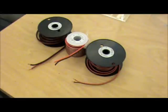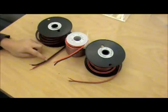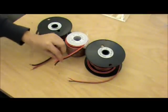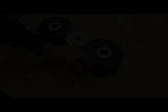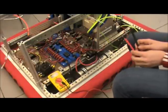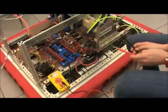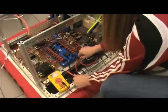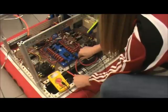Note that an electrical inspector will always check to make sure you use the proper minimum gauge wires for each component. The 12-gauge wire is used when you have a 40-amp fuse, usually for CIM motors and Fisher-Price motors. The 14-gauge wire is used with a 30-amp fuse. The 18-gauge wire is used with a 20-amp fuse. As part of your electrical inspection, the inspector will make sure that the electrical components are isolated from the chassis — use a voltmeter measuring at ohms to verify that there is no continuity between the chassis and ground.